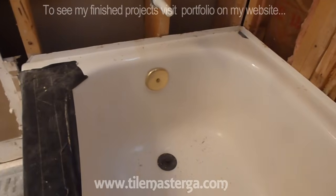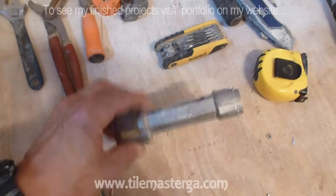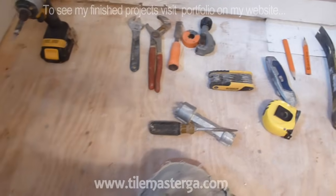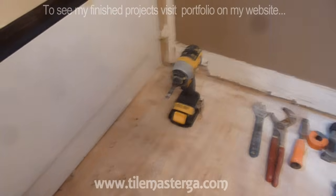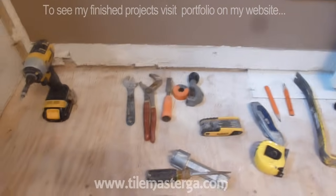In order to do that I will need some tools, and I have all the tools ready. What will be needed: this special tool to unscrew the drain, a flat screwdriver to disconnect the overflow, and a Phillips screwdriver might also be needed. In this case I have a screw gun, so that might be helpful. So let's start from disconnecting those pieces and you'll see how it's done.